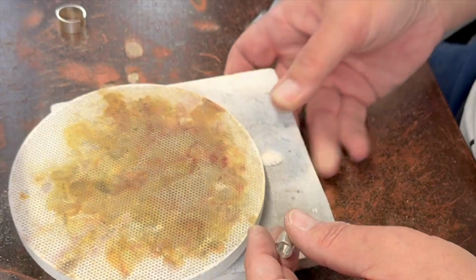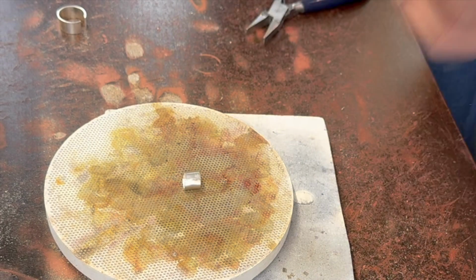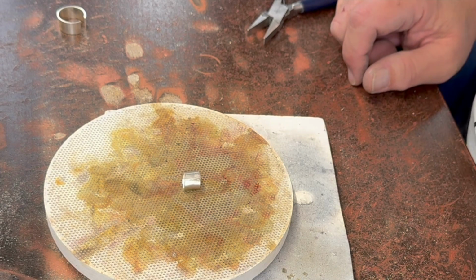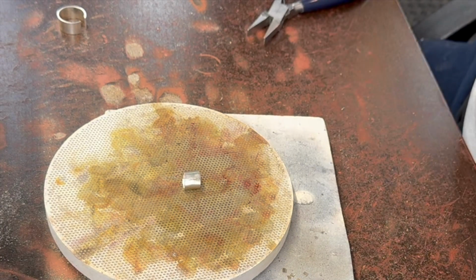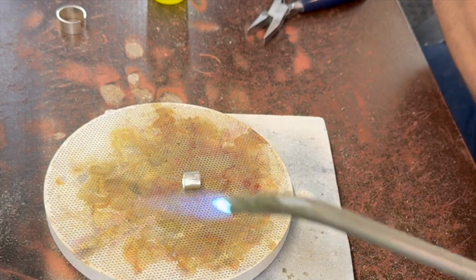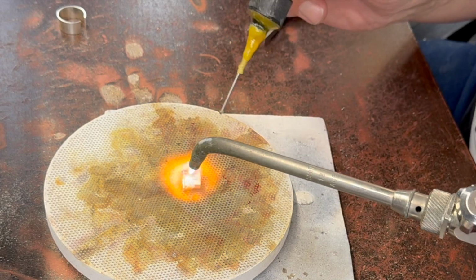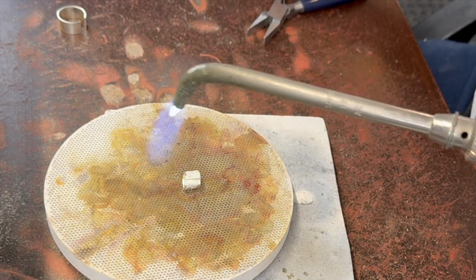I'm just going to cut a piece out of this anyway afterwards, but I want to get it nice and round first, so that's why I'm soldering it together. If you haven't been to my channel before, I use hard silver sheet solder primarily. I use a liquid flux that I dribble on from a little bottle like that usually. My torch is a Silversmith model. It's their acetylene air torch, and it's a really good torch for silversmithing.